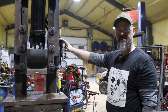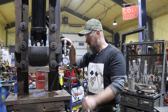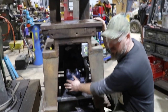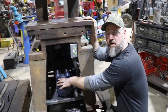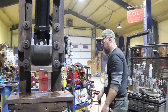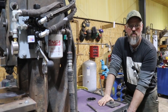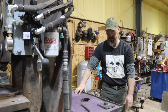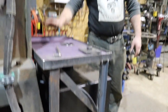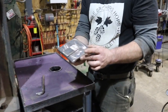The press is controlled by this Prince log splitter valve — it's a 3000 series Prince — and I have a pressure gauge here. I adjusted it from the factory settings; I understand I can also increase the pressure. The on/off switch is under here. I have a five-horsepower, 220-volt motor, a three-to-eleven pump, and coming around here, a 20-gallon reservoir with 15 gallons of hydraulic fluid in it.